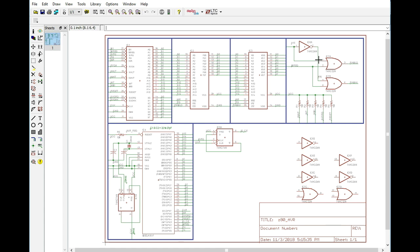But anyhow, we're going to toy around with this circuit a little bit. Like I said, I'm going to replace the memory decoding, and I'm going to add in, I guess you could say, a data address latch here in order to be able to generate those signals. So we're going to go ahead and do that, and I'll be right back, and we'll see what we need to do next.